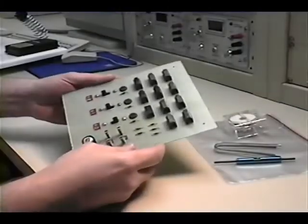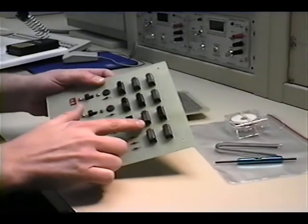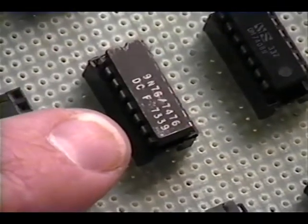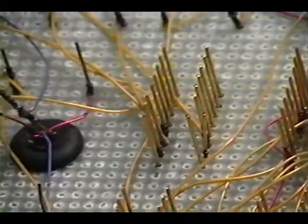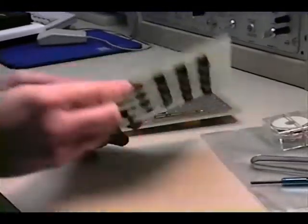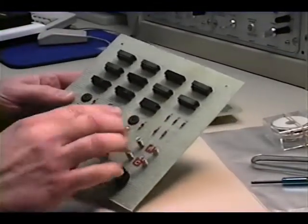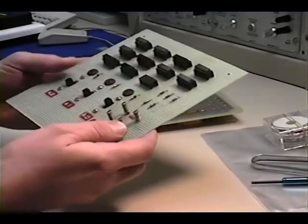Hello, in this tape we're going to be talking about wire wrapping and some methods for wire wrapping. This particular circuit board shown here is a finished prototype for a small circuit using a perf board. This perf board is already pre-drilled or punched so that wire wrapping components can be installed. The holes are all on tenth-inch centers. The originator actually incorporated switches and other components all onto one board to make a finished device.